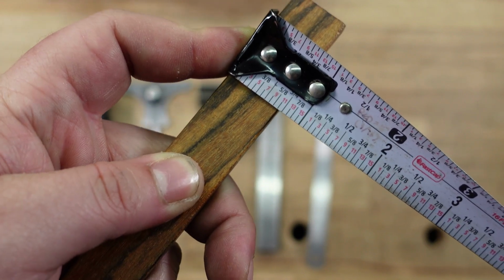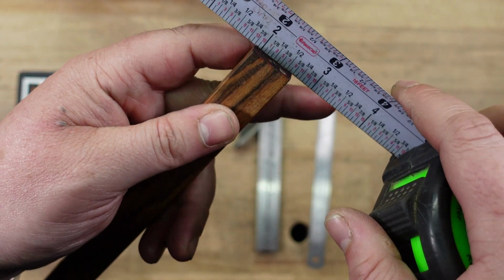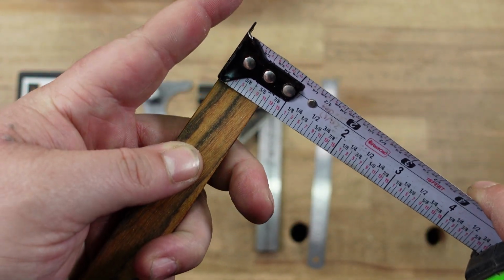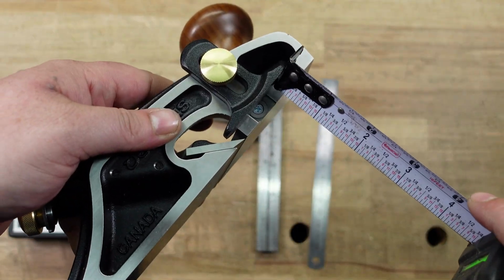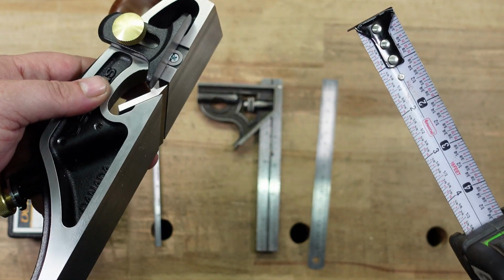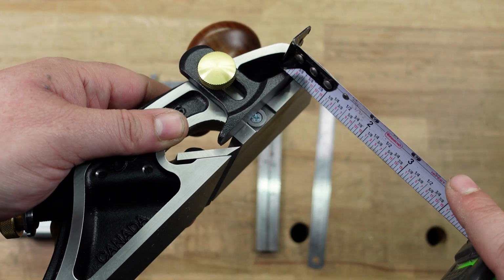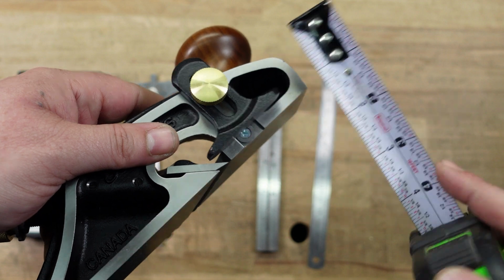This tape measure accounts for it when it's in the pulled motion. I can tell that because when I take this board and line it up to that, you can see it goes to 11/16. So this tape measure accounts for it when it's pulled. If you're going to use this to set the depth or set the stop, and you're pushing like this, it's going to be a 1/16 off. See what I mean? The other thing you can do is line up the board onto the 1 inch or the 2 inch, and then try to set your depth stop, but that's leaving it up to you.